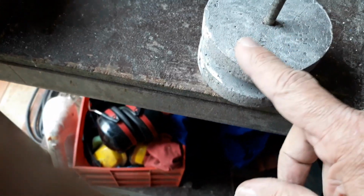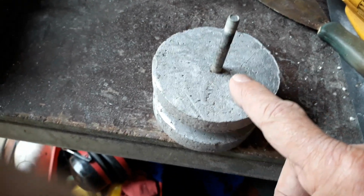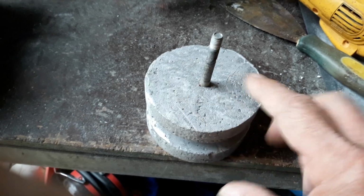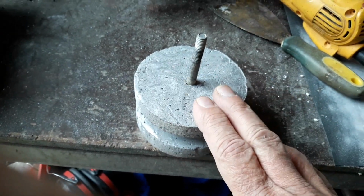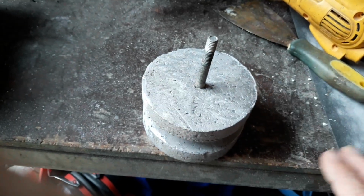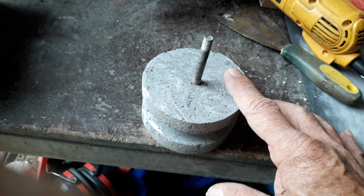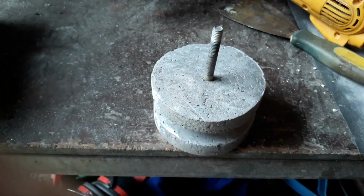This part is where the riser was. What I like about putting the Cornice moulding on the mould before I pour the aluminium is it keeps the detail very accurate. It really works well. I haven't tried it into straight sand, but I believe that using this Cornice cement really keeps the detail well. So that's it. I think it worked out quite well.